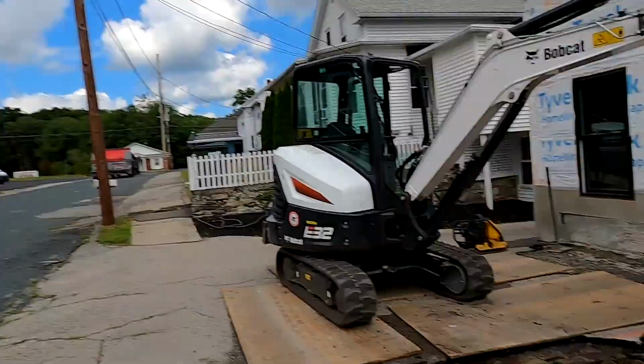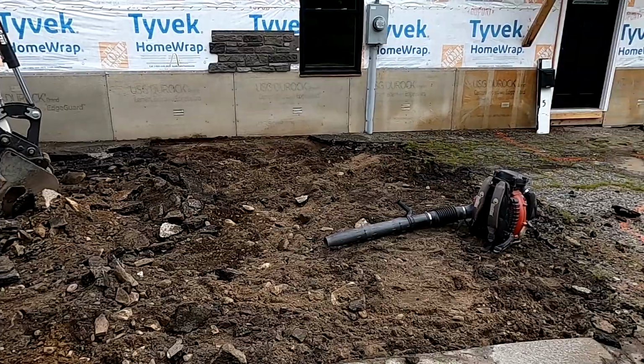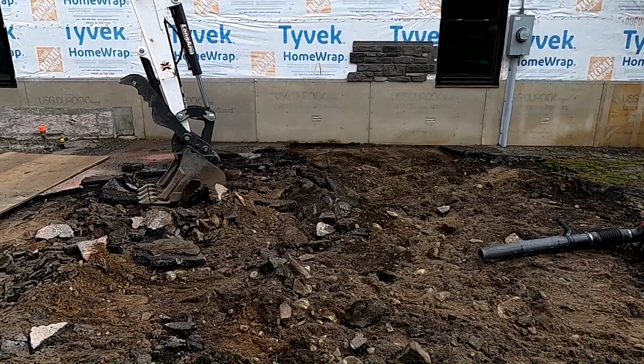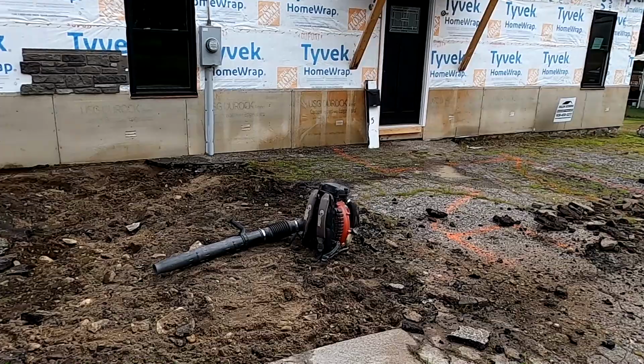All right, so he's gonna go dump that asphalt, pick up a load of 3/4 inch clear crushed stone so that we can start backfilling as well. And while he's gone, I'm gonna pull the rest of that corner of asphalt out and then pull all the asphalt, all the little pieces, everything, down over here. And then I'm gonna start excavating on this side, and I'll leave a pile over here somewhere. That way when he comes back, I can load him with some asphalt. He can leave and then I can keep doing a little bit more excavation and backfilling.